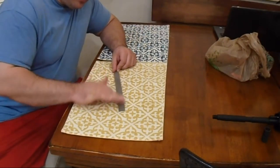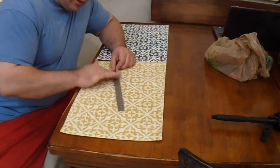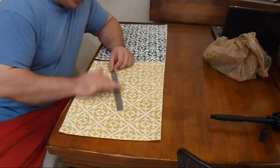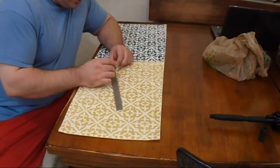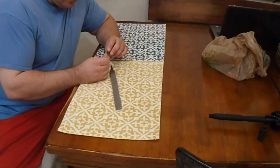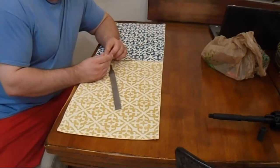You don't have to press hard or anything. You gotta let the teeth do the work. So don't bother pressing. Eventually, you're gonna have to wash out the grooves because they're gonna be overloaded with metal. You'll have to do that before you continue.